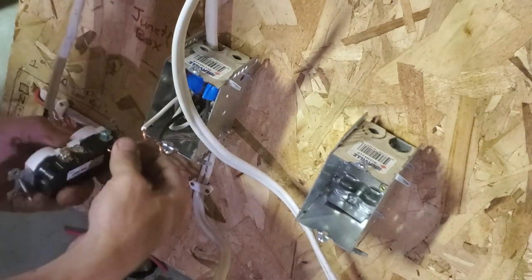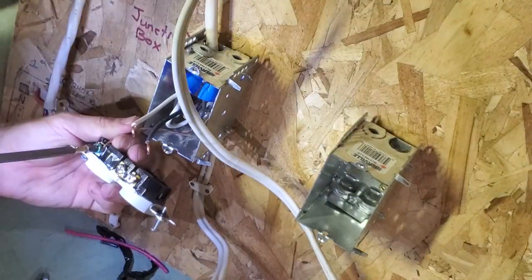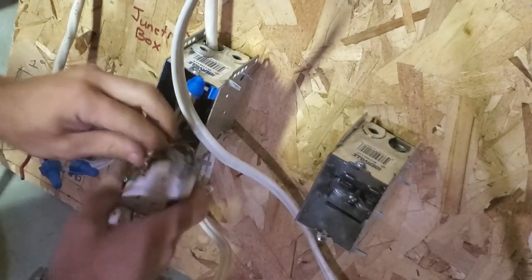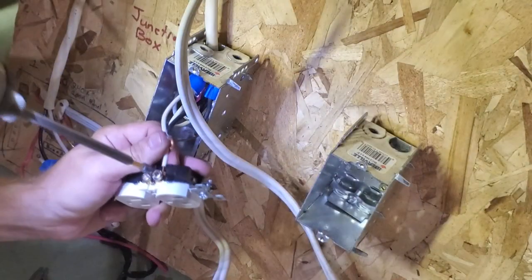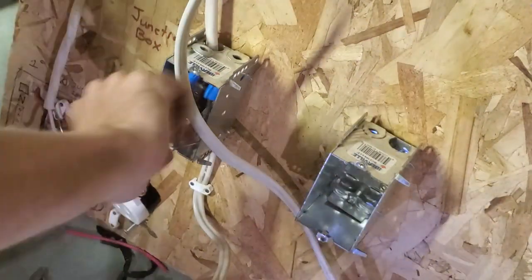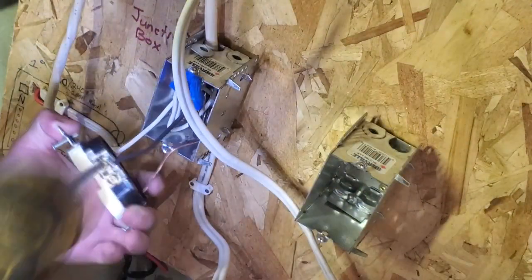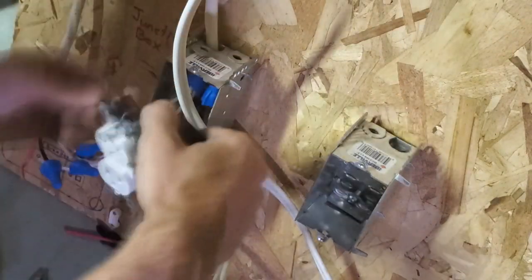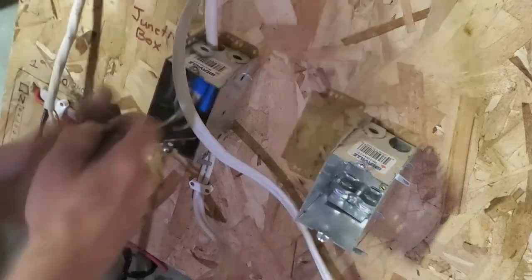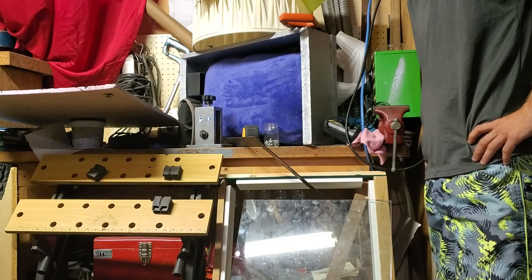Start with the ground. Give it a little notch up and it'll catch on this, tightening up. Put that on. Your loops are going to be going down. Flip your black upside down. Now for a little extra safety. That's just some basics on wiring the plug — that's pretty much the end of it.